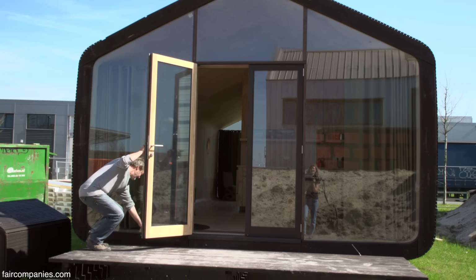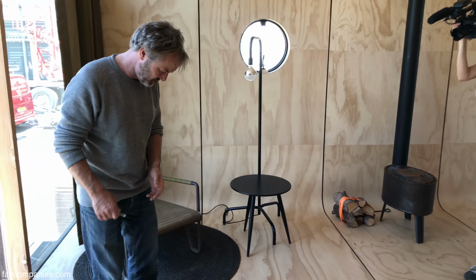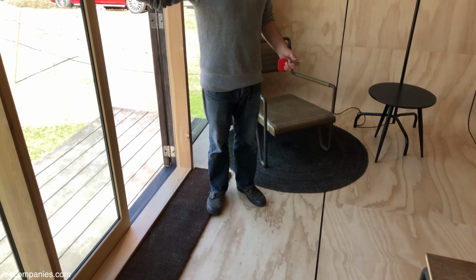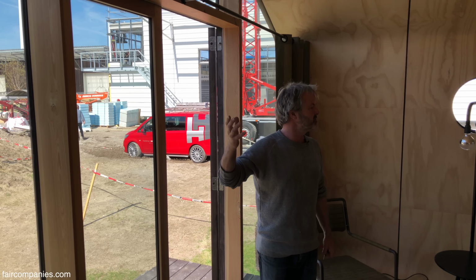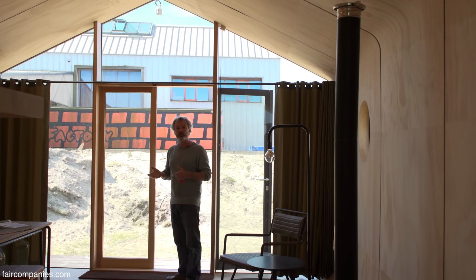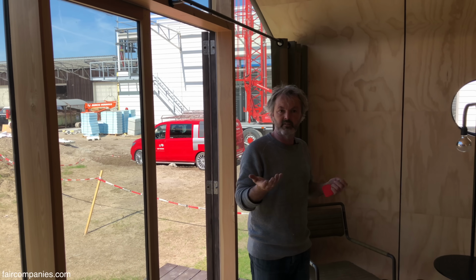So now this is the first element. This is the first section. Here you see the seam. This is 1 meter 20. This is the seam, and this is the one with the facade. So this is the flax one. This is the one which is exposed mostly to the environment, to the wet. So here we decided not to have the cardboard one, but to have the flax one, because that's more traditional, more reliable, we know more. We have to put a guarantee on the house.